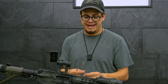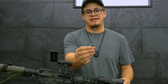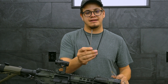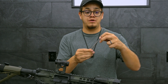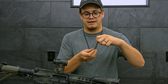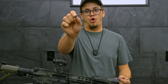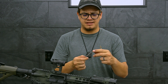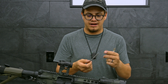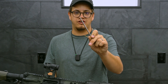You're going to get two different ends with it as well. One end is just a simple textured end that's intended to be a stop for if you're getting a stuck casing out. We do not recommend you trying to get a stuck casing out using just an open end with nothing in it — you're going to potentially damage it. This is made by a Swiss machine, so it's very high quality, but just for the longevity of the tool, you're going to want to leave that end in there if you're getting a stuck casing out.